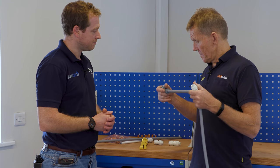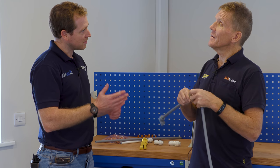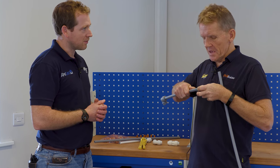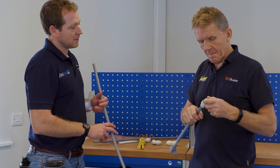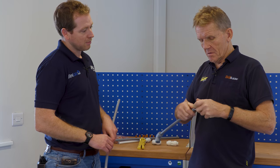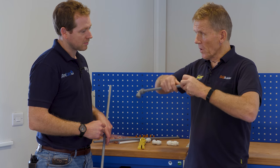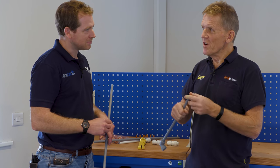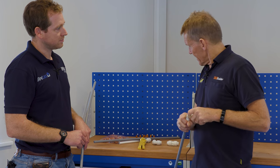You don't put witness marks on your pipe? No, we used to, but we found that the insertion depth of different fittings doesn't always correspond with the markers. Most of the time, if you're a plumber, you know when it's in. If it's the first time you've ever made a joint an insertion marker can be useful — a lot of people do it with a pencil anyway, and there's nothing wrong with that. What I do like is the fact that when you demount that fitting, you're not leaving the liner inside the fitting — which can be very annoying.